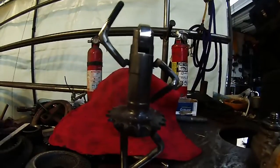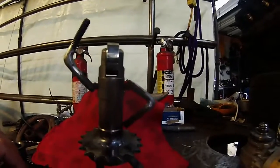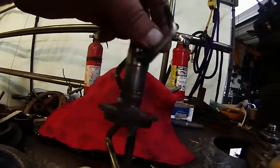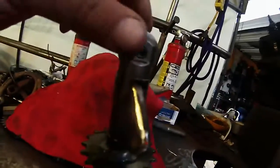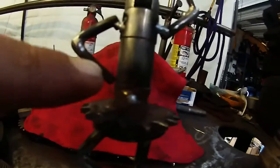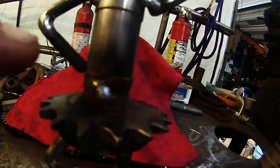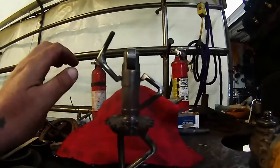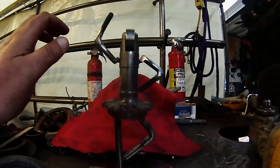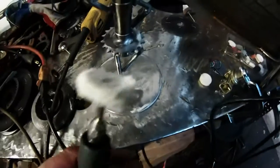Alright YouTube, I got the arms on, got them welded where I like them, and cleaned them up with the flap disc. I put on the old one — the one with the grid cleaned it up a little better — and I'm actually liking how it turned out. To get them on the back I just put one tack on each side, which is all you really needed. Also, when I was using the flux core burning on the inside from underneath, I did burn a hole in her buttocks. I filled that in once I had the wire and gas hooked back in.